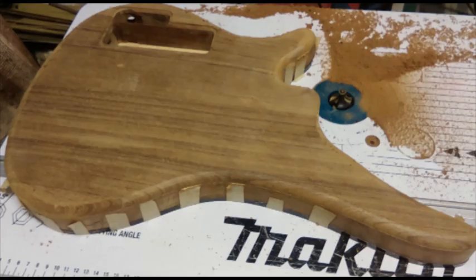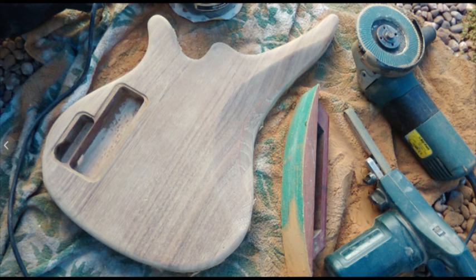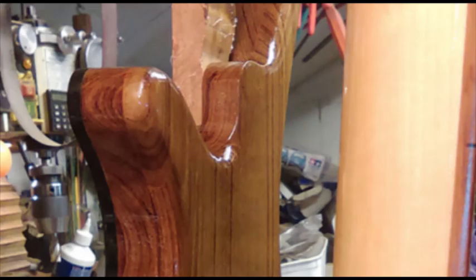The back of it was simply routed with a radius just to soften it. And then I took to it with a few shaping tools, just a flat wheel on an angle grinder and my trusty Black & Decker power file, one of my favourite tools. And that was then softened up by hand, and the process started of sealing it all up. Quite a lot of sealer needed for this, very open grain teak, quite dry.